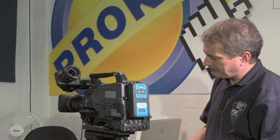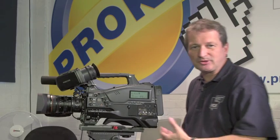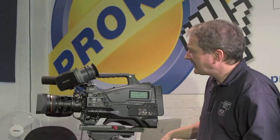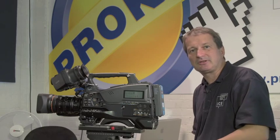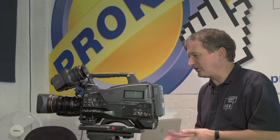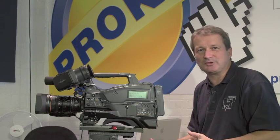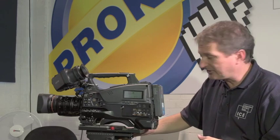A couple of other differences. There are two HD-SDI connectors on the back of the camera, which makes it easier if you've got a location monitor and another bolt-on device that needs an SDI feed. And finally, there's the option to put onto the back of the camera either a triax or a fibre studio adapter. So if you need to integrate these cameras into a studio system for a college, university, flyaway kit, or corporate event production, there's a really cost-effective, sensible way of doing that — either triax connectors with widely available cable, or a fibre optic cable connecting back to a base station.